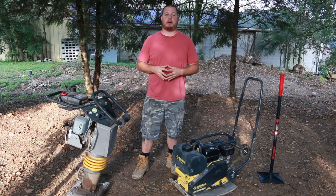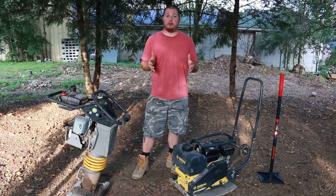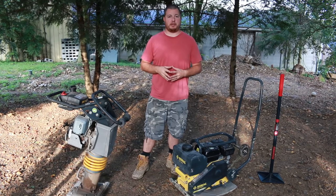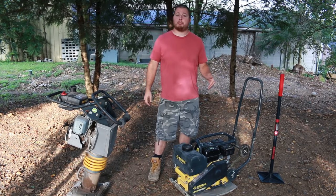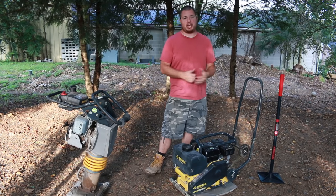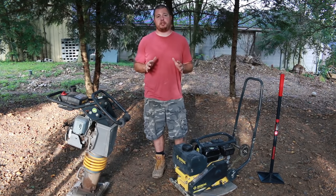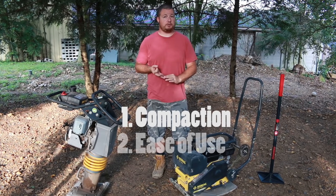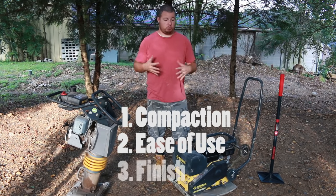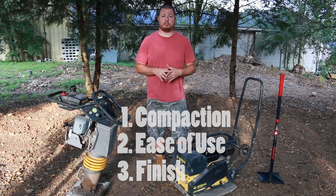Hey guys, Sean Lentz here from Appalachian DIY, and today we're going to go over different compaction methods. We have a jumping jack tamper, a vibratory plate compactor, and a good old-fashioned hand tamper. Now we're going to evaluate these three different ways: compaction rating, ease of use, and finish, what type of finish they give when we're done tamping.